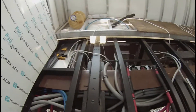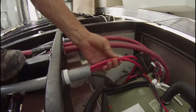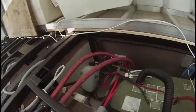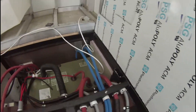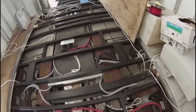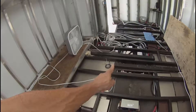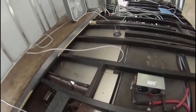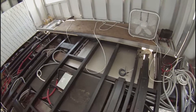I've got four of these guys in this one-inch conduit - I was able to get all four of them in, which worked out amazingly. That's running 12-volt. I've got a light here, I've got my 110 already run in, and all the plumbing's in. I've got conduit everywhere and I'm pretty happy with the way it turned out. I've got most of it run along the frame rail and the tank, so it kind of locks things in place. I think there's three or four runs on one side, two on the other, and then another layer down with more pipes and conduit.